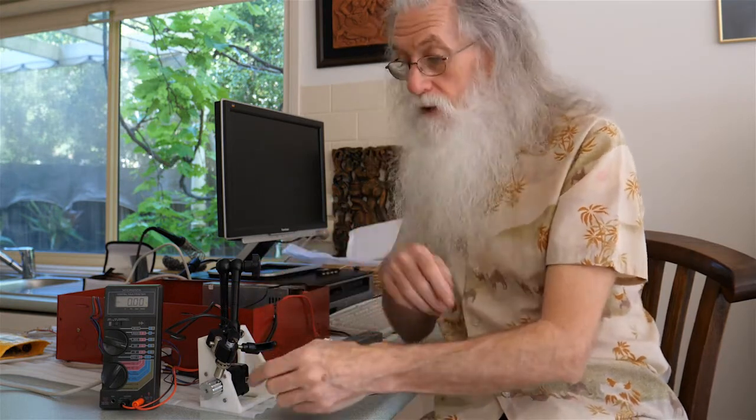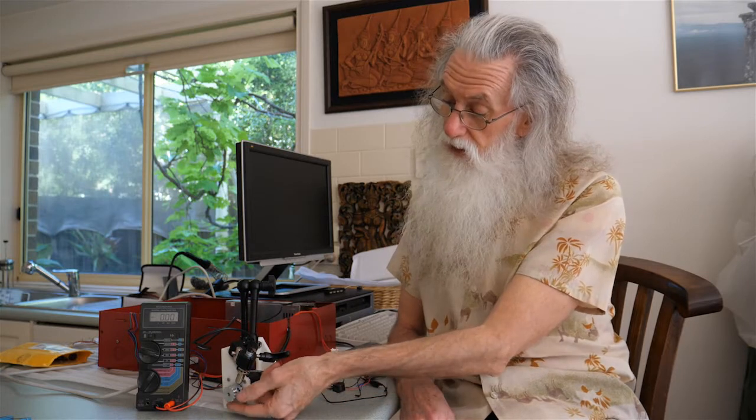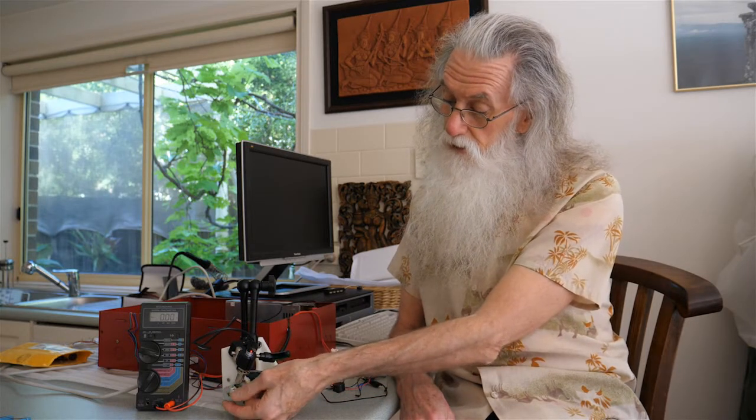As it's a smaller magnet, the distance is less, and I need to know whereabouts in the centre of the sensor it will pick up. I can move this arm around and adjust it to pick up the magnet. I've just got the box of magnets, pull them out, run underneath, and I can see it roughly in centre. The smaller the magnet, the more it has to be in centre; the bigger one can be off-centre. I can adjust the arm up and down, test, and measure the distance.